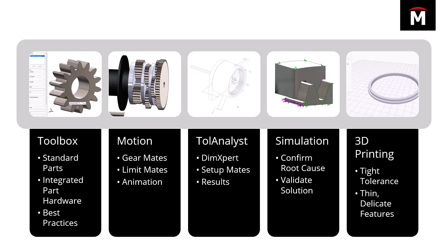From that I discovered how it worked and tried to figure out why the two parts would either disengage prematurely or not fully engage. Once I had a full understanding of how they were engaging, I wanted to understand if that was going to cause failure — I needed to make sure the failure mechanism I suspected was actually the cause. Running FEA, you can determine whether something makes sense or couldn't have caused that issue. Then at the end I did some 3D printing to solve the problem and get the winch back up and running in a very short time.